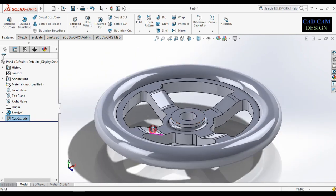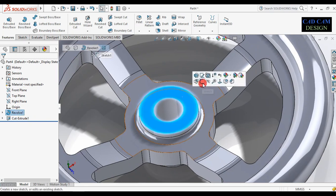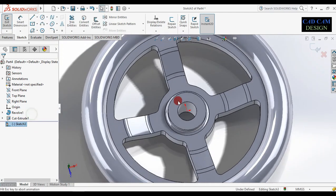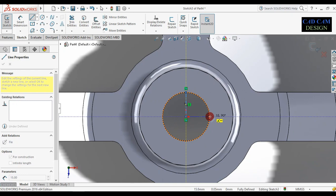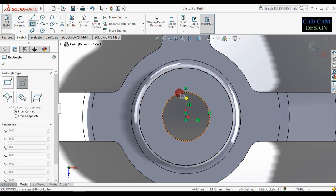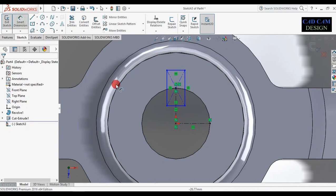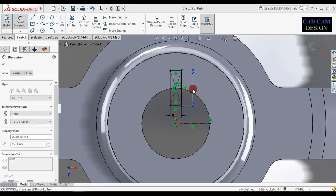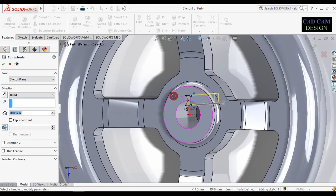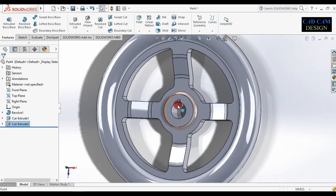Our object looks like a handle now. The first half is done. Select the surface sketch and set to normal. Draw a center line like this, then a center rectangle — draw to this point to make a keyhole. The line length is 5 mm and this line is 10 mm. Go to feature, extrude cut, and done. The keyhole is complete.